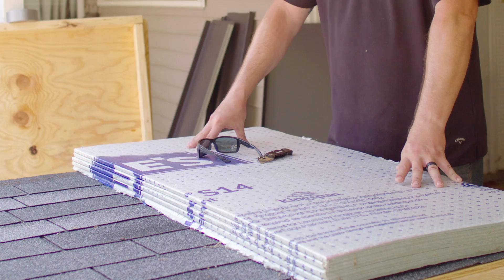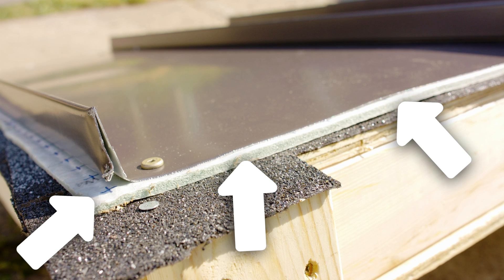It's not a real big shock to see metal getting as hot as it does — same with the shingles. They heat up; the shingles are thicker and they retain the heat. What was surprising was how much difference the thermal break in the assembly makes in the overall temperature, whether it be metal over shingles or metal over iso with shingles — both performed better than expected. A thermal break is basically anything that creates a separation barrier to break up that thermal transfer in the assembly. With metal over shingles, the shingles act as a thermal break, and with metal over iso over shingles, you have both the iso and the shingles acting as a thermal break.